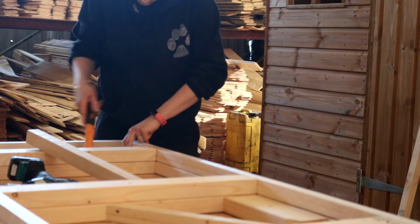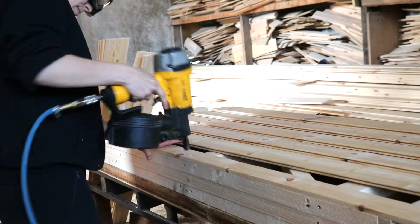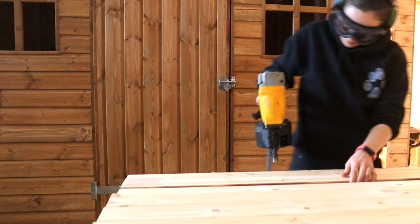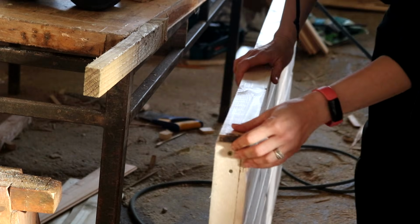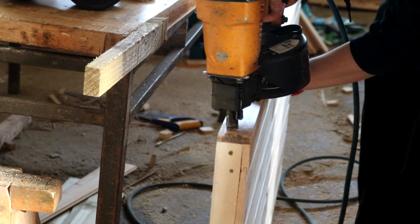And I'm sure you've seen enough of me cladding already in this video, so I'll just quickly tell you that all 3 doors this time were cladded vertically in a contrasting direction where the overhang still matched the rest of the shed. Then 2 flashings, one either side, but I had to make sure that I didn't nail where that lock was going to go.